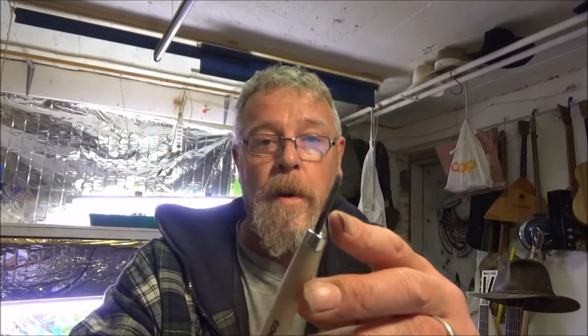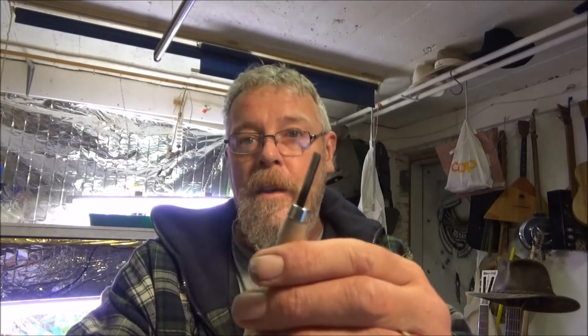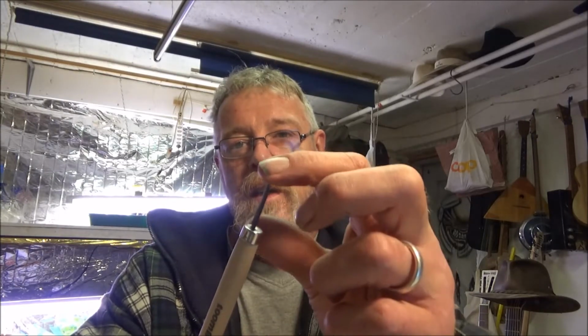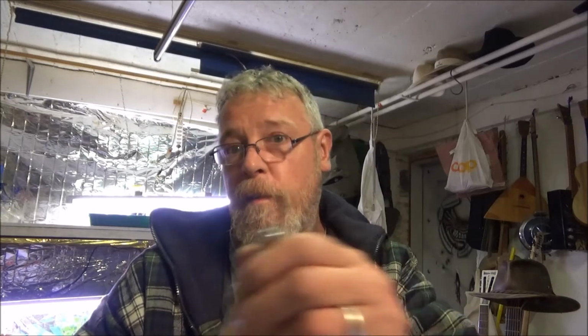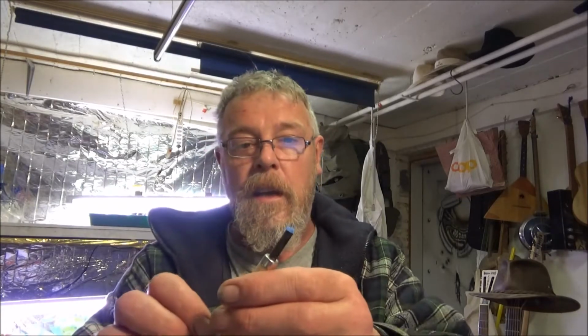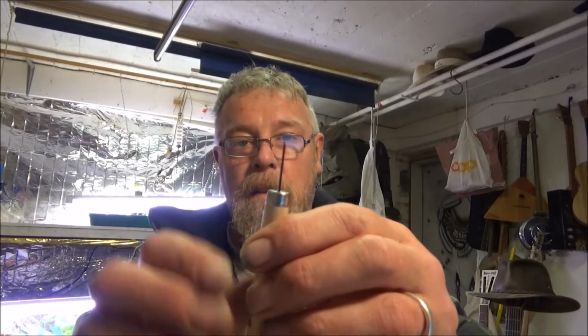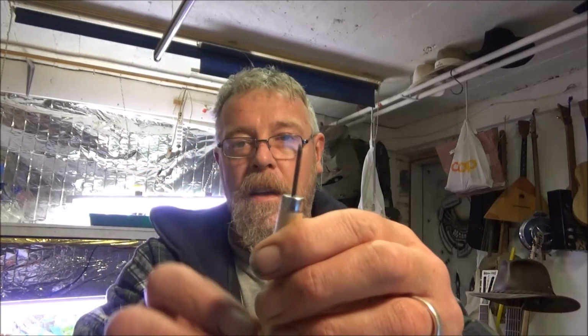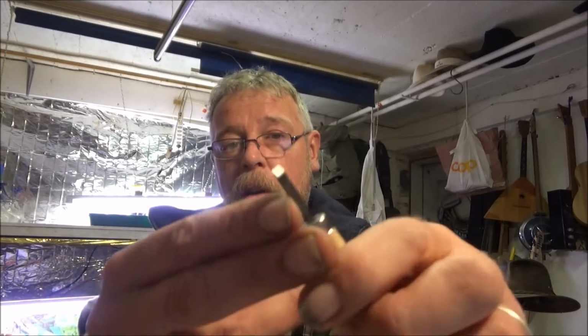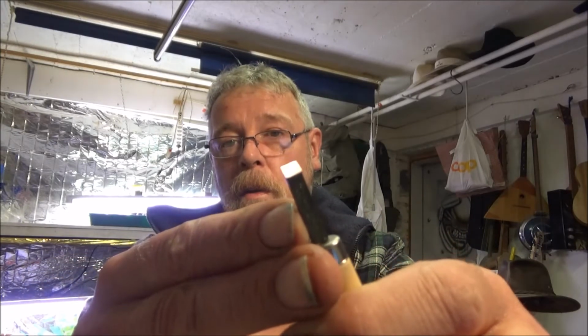What I'm going to have to probably do is put a second bevel on them, because with a too fine angle, you're curling ends over slightly on some flat blades. That's all right as a gouge, but the flatter blades need a slightly second bevel on it. They're so fine on the ends that when you're using them, you can curl them easy, and I don't want to be curling them. I want them to stay sharp, so a second bevel on the back won't do it any harm, you know what I mean? But I'll get on with it and show you the tools.